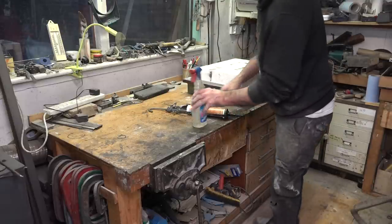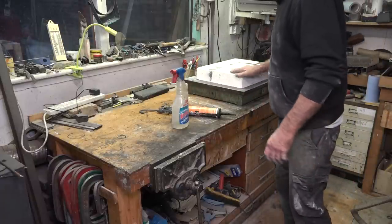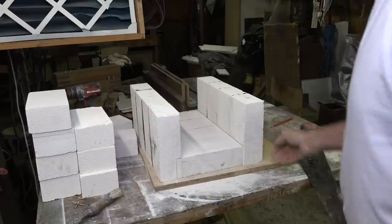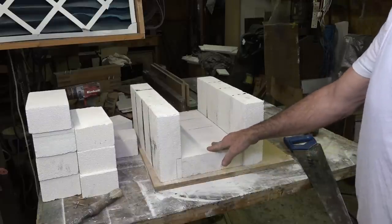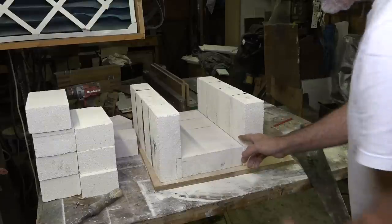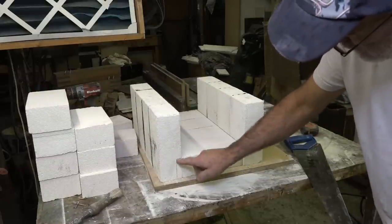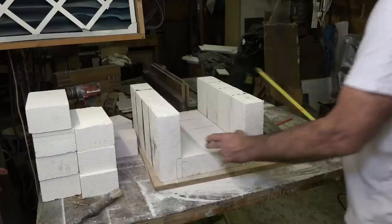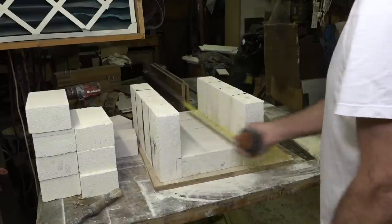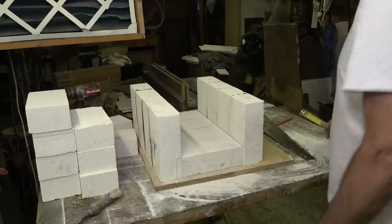Give them five or ten minutes to grab and then I'll just put them to one side on a flat surface and leave them 24 hours. We've got the sides and base of the oven - the internal dimensions are about seven inches wide and I'm going to notch out the sides so that slides in. This will comfortably heat treat four or five knives at once, which is more than enough. The length of the oven is 18 inches, which again is more than enough for knives.